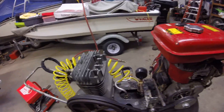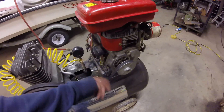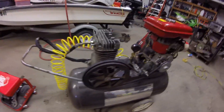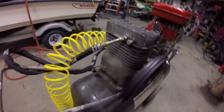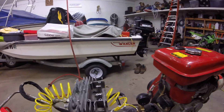So I just had a bare tank — nothing except the motor, pulley, some belts and bearings. This tensioner I completely cobbled together out of stuff I had laying around. This pump — I traded it for a bunch of scrap metal I used to have sitting there with my grandpa. I took that and put it on here, and it's the same pump that that air compressor over there has — the same identical pump. So I didn't have to drill any new holes or anything; it mounted into the original ones. This one just flipped the other way because the gas motor turns that way.